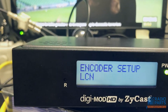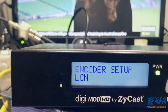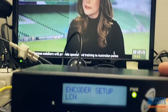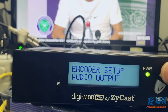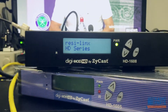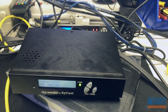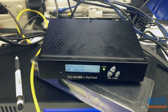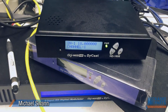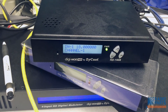Remember to change the LCN if you're going to use multiple of these together. By default it is on 101, so if you type 101 into your TV screen it'll bring up your modulator channel. Overall it's a very simple modulator — one of probably 20 different modulators in the range and the most basic one. One thing to remember: it's HD but MPEG4 only, so if you've got a really old TV — 10 years plus — you might need a set-top box. If it's a more recent TV it should be pretty much plug and play.